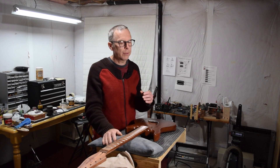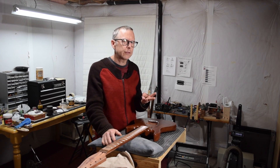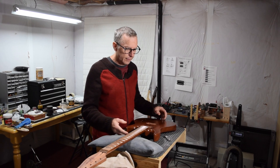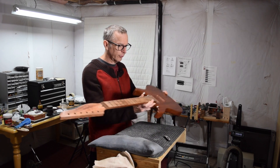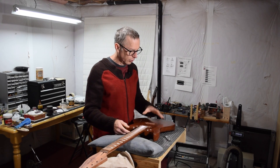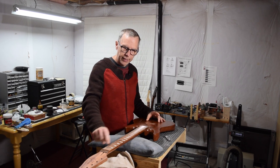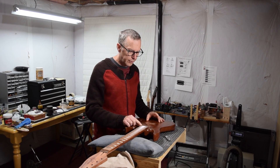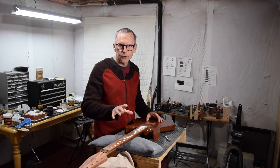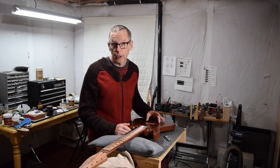The next question is: how do you determine that angle? There are really three ways. One way is to do a full-size CAD drawing of your guitar's side elevation, including all the components, and check whether the string leaving the bridge and heading to the nut is touching those last few frets. If not, you angle the neck in the drawing until those strings come down to touch — with the bridge in its lowest position.